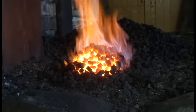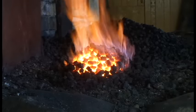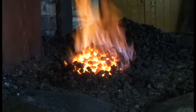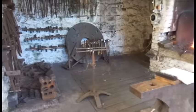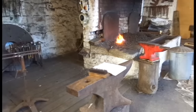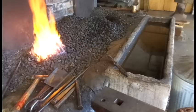The fire is one of your key tools as a smith, as it's used to make the metal malleable. It can be gas, induction or solid fuel like mine. It's usually known as the hearth or the fire, with the forge being the building it's placed in. The fire is best positioned in an accessible place within the forge and should be capable of accepting large stock sizes.